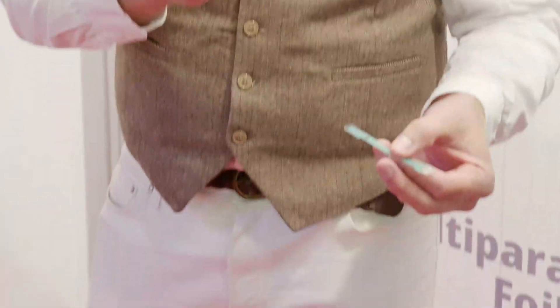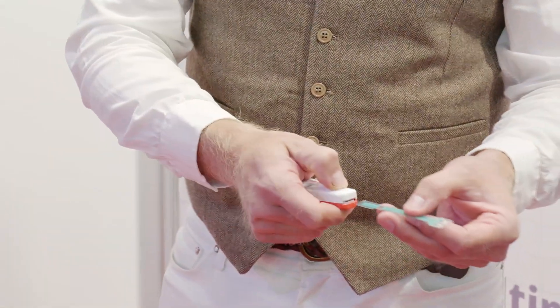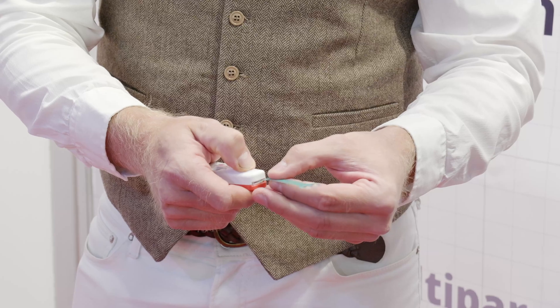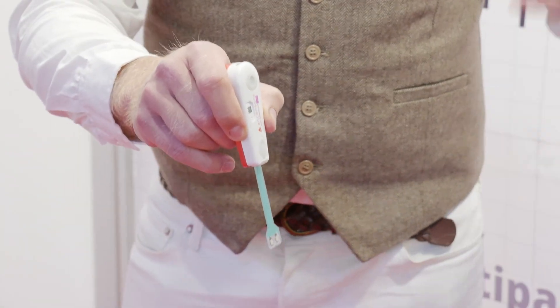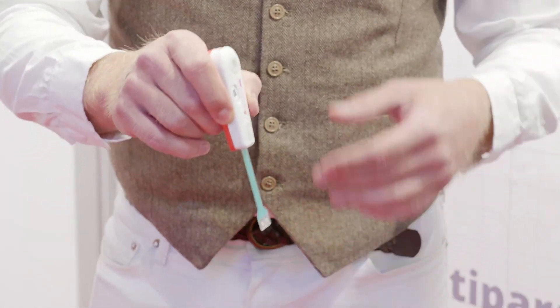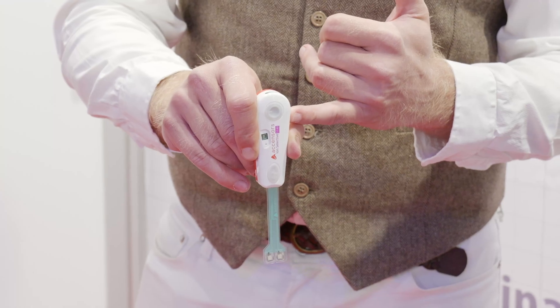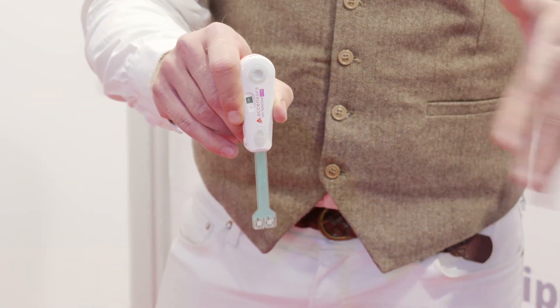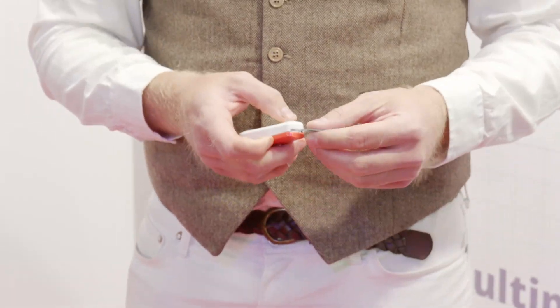You need a measurement electronic. We have a measurement device where you press a button, insert the periphery foil, and it's fixed. Now you can put it into coffee, water, urine, blood — whatever you like — and you get the data via Bluetooth protocol on a smartphone app. Then you can see what's happening with your pH value over a couple of days.